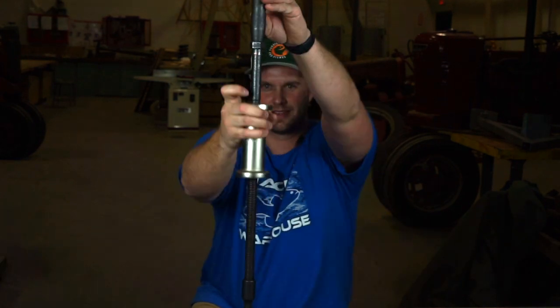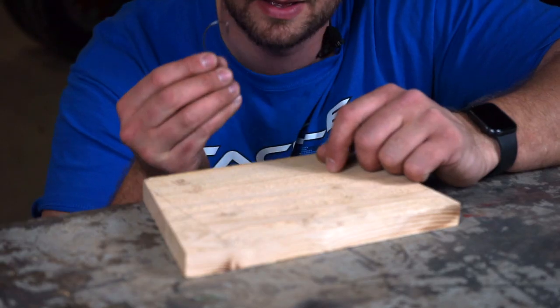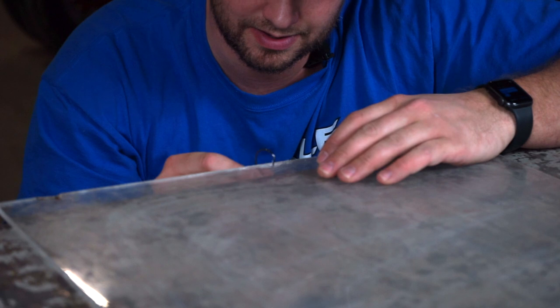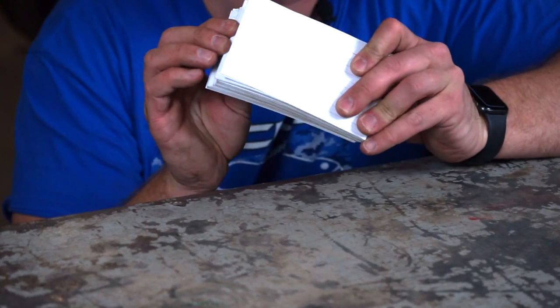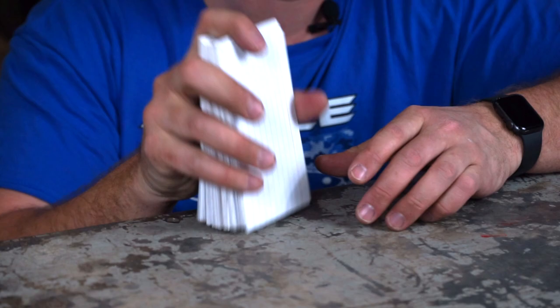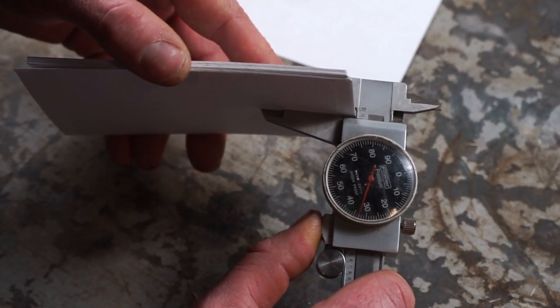Moving on to the sharpness test. We marked a spot on this slide hammer with some tape so our drops would be consistent each round. We lifted the weight, put it at the mark, then dropped the slide weight so it would land on the hook. The hook point would then go into the material a certain distance and we would measure that distance. We tried wood, plexiglass, and vinyl tiles — all too hard. We finally landed on note cards. Every one of these note cards is seven thousandths of an inch thick. We'll use a caliper to measure to the nearest thousandth of an inch.